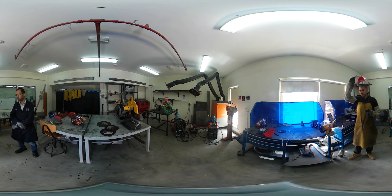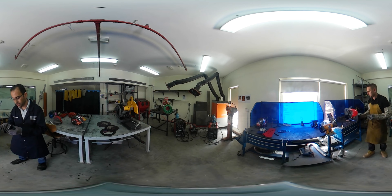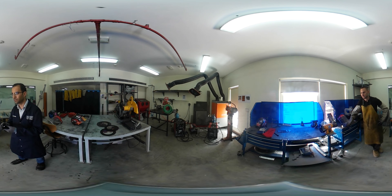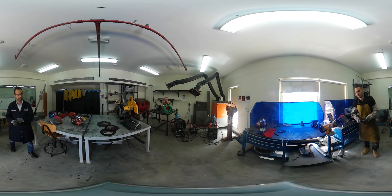So now that is the grinding part done. It is worth noting that we are using grinding today for preparing material for welding, but grinding is also used as a precise manufacturing process — for example, when working with fits, if you want a tight fit for a specific component, you would remove a small amount of material. So welding is our next stop.